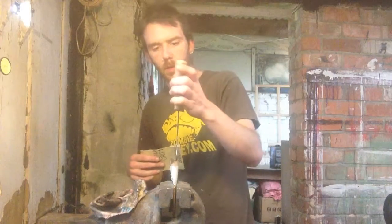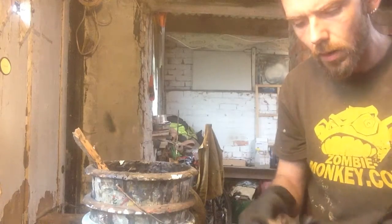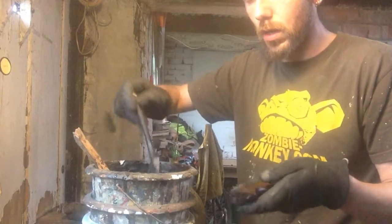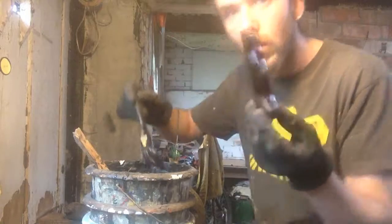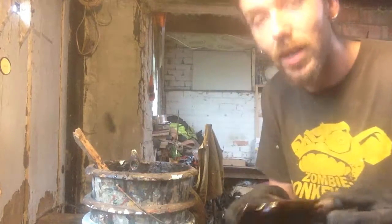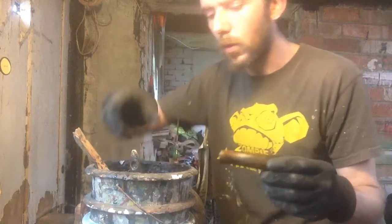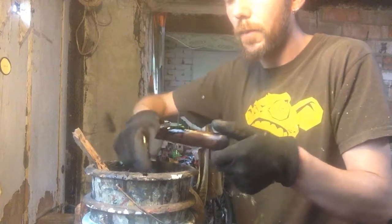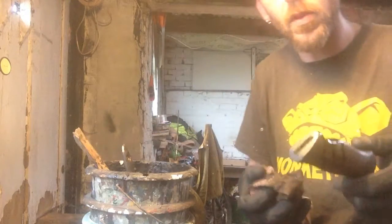Yeah, try and do this while it's still warm. Get a coat of bitumen. I need gloves. May quickly give this just a second little rub down. Whatever you do, don't try reheating this or drying it with a blowtorch, because it'll go up like no one's business. You can kind of buff this stuff in as well, it dries so quickly. And then if you get any patches you think could be a little bit darker just there, just give it a few seconds to sink in, and you buff it over again.